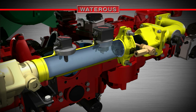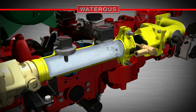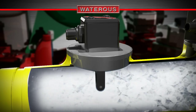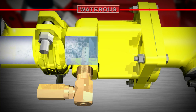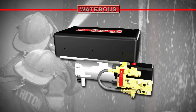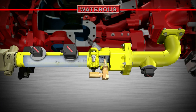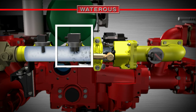Before entering the foam manifold, the concentrate travels through a foam check valve just before the inlet, preventing any water from migrating into the foam tanks. Moving forward, the water and concentrate mixture — or foam solution — travels past the solution conductivity probe, which measures the water-to-concentrate ratio. If the ratio is not at the set point, the microprocessor automatically adjusts the foam concentrate delivery rate. A temperature sensor also tells the microprocessor the water temperature, and it adjusts the foam injection rate to compensate for colder water. The paddle wheel sensor measures the current rate of flow, which is displayed on the operator interface terminal.